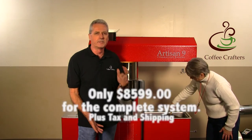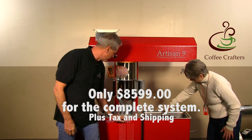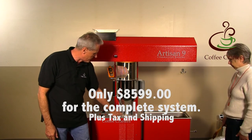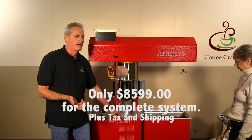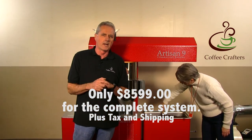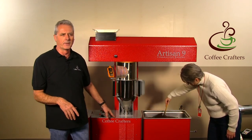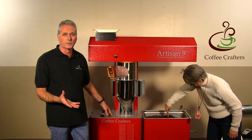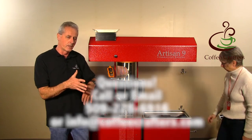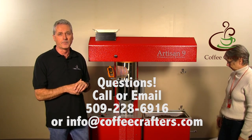That was it — we just roasted an entire batch of coffee. You'll notice our exhaust blower is still running and I can put my hand all the way up inside here right next to the chimney. You may have heard on blogs people talking about heat accumulating on top of the Artisan 6 — well, the electronic void on this machine is also cooled via the bean loft blower. It sucks air through, cools the electronics, and when we added that to the system we stopped losing electrical components.